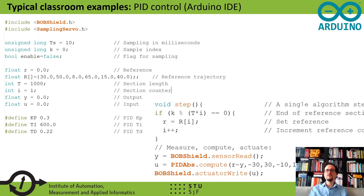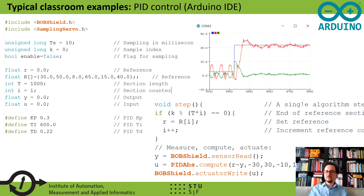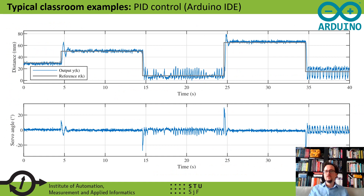Our library contains typical classroom examples such as for system identification or feedback control. The code snippets shown on this slide demonstrate PID control of the BobShield so that it follows a given reference. The experiment can be watched from the Arduino IDE serial plotter — no auxiliary equipment or software is necessary. The screenshot shown here demonstrates how the ball follows the given reference. Data can also be exported to other tools such as MATLAB, and these results show very decent tracking performance for an experimental system that can be made for less than $10.